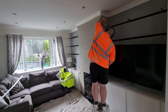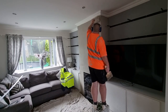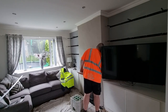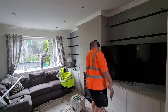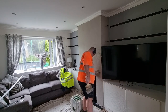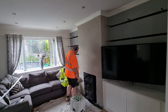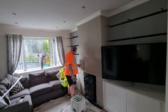And then you're using the Prima shape — it's brand new but it's called like pre-worn. They're good for this because they're like sort of blunt, and they're good at cutting the plaster. That's the reason I use them. A lot of times I find when you're just using your regular trowel, your nice sharp trowel — for this final pass it doesn't take enough off and it can leave like lines and bumps and stuff if you're not super experienced. So I just prefer doing this. You can see I use the brush and sort of agitate the plaster — it's sort of leaving like a stipply effect on top of it. And then you're cutting with a decent bit of pressure and a good angle on your trowel, cutting into the plaster and taking any big humps and bumps out.